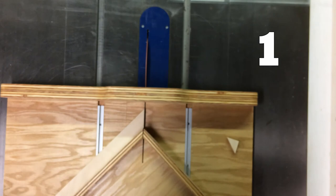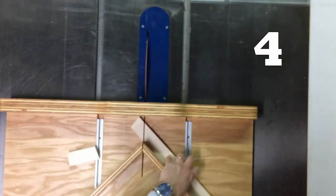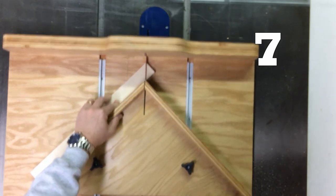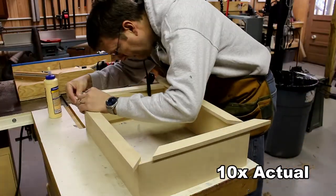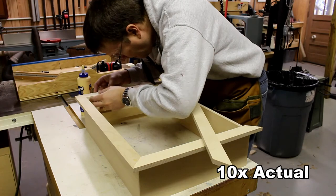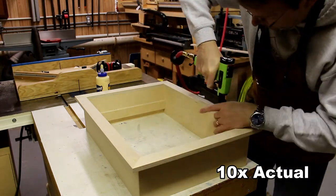Now that the box is put together I'm working on the frame. I'm using my table saw sled with my miter attachment. I'm cutting through the joints — on the fourth one each joint alternates left and right, so any error in the setup cancels out because you're alternating sides. Once they're all finished I start assembling the frame: gluing and brad-nailing the top piece in place first, then the sides, and once the bottom piece is glued in I go back and finish putting brads on all the sides and reinforce the corners.